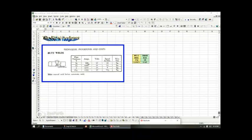And you're like, whoa. That is way higher than what IRONDESIGNER talked to us about. So remember, you are down in the 1/4 inch thick plate. So if you are 1/3 of that, because you're at 3/4, so you go down to 1/3, you're at one quarter, right? One quarter plus one quarter plus one quarter is three quarter. So you want a third of the amps, and it would be 300 amps. The volt seems to stay the same. Maybe it might go down to 30 or 28, 29 volts. You know, if you just do a linear interpolation on down, it doesn't look like it's got such a great slope. And then here you go. Your speed in inches per minute is going to be around a third of that. You know, but for hand welding, you know, 1 to 2 inches per minute.